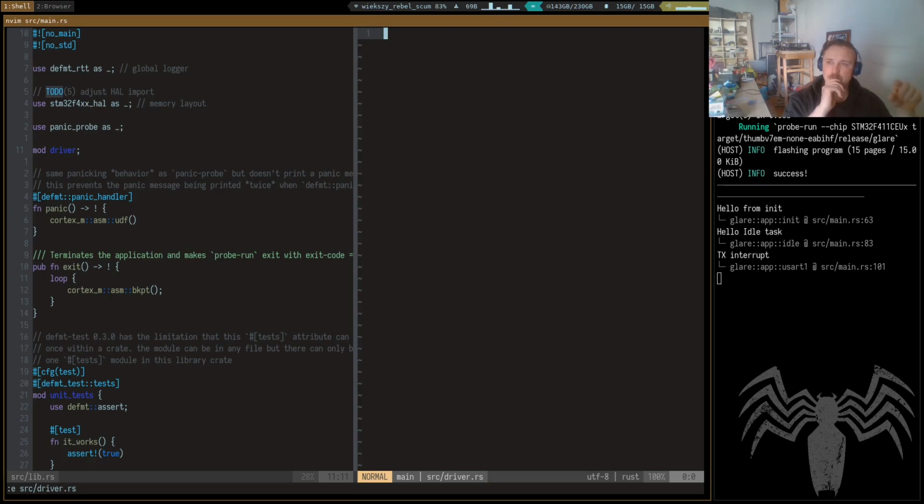So that means I don't really care about the transfer being interrupt driven, as in serial interrupt driven, because I think there's going to be some sort of interrupt on the frame availability coming from the camera, so we want to trigger then, grab the whole frame and send it to the remote device. But we do want some kind of acknowledgement, or ACK, being sent from the remote side. So we probably want some interrupt on the RX side.